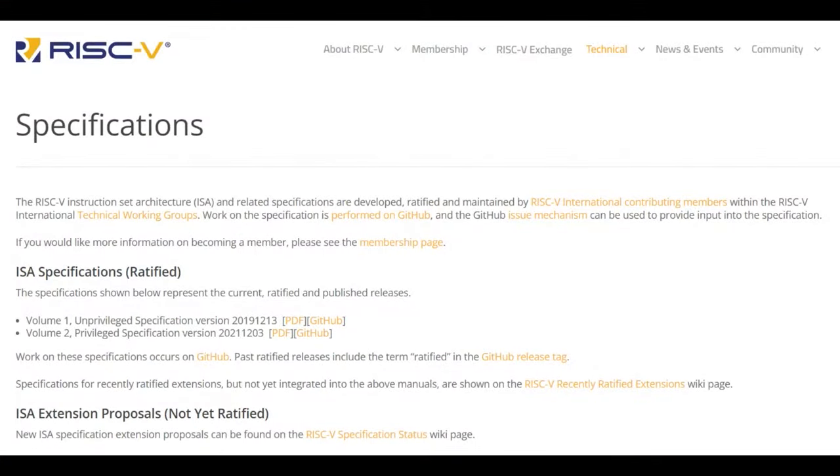The RISC-V core processor inside — there's a quad core based on the RISC-V specification, so it does not have an ARM core instead. And this is not implemented on the FPGA. These are actually separate, on the same die or package as the FPGA. You're not emulating the RISC-V — the RISC-V is in silicon. It's not emulated and implemented within the FPGA. It follows specifications.